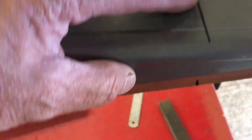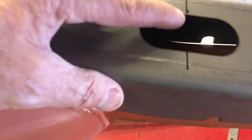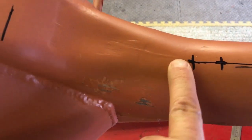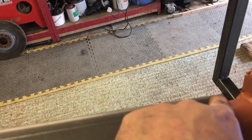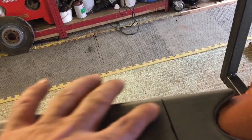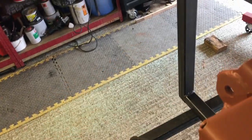I've also got to think about the breather. The breather tube is here — the original one — and I've marked the position. If we put this on like this, the centre is there, and you can see it starts to angle up, so I've come over to a bit where it's straight. I'll drill and tap that and put one in there. I'm thinking I might turn up a tube and fit it inside here with a six or six-and-a-half mil bore so I can run the vent pipe through and out. I could have it coming out this way over the top of the axle, but that's going to be susceptible to getting trapped, so I'd rather have just a little bit exposed there — I could have the pipe extended out to about where my finger is. We'll see.